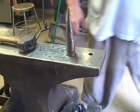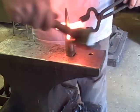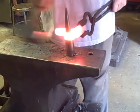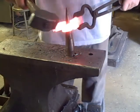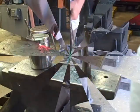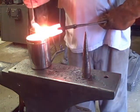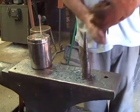I'm going to make the round using this hardy tool that I made. I need to work on it a little bit so it's better sized for my hardy hole — it's about an eighth of an inch too small, but I can still use it. I use it for a lot of things; I just need to build up that base so it doesn't move around so much. Get it into the circle. This is borax — 20 Mule Team borax, the same as what you buy at a grocery store. Put a healthy bit on.